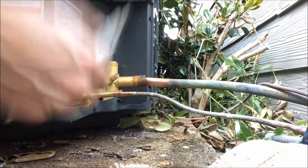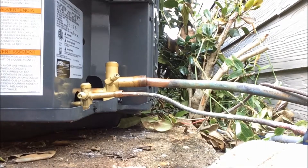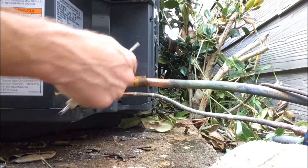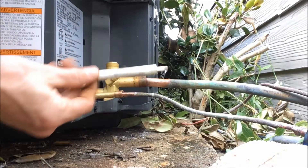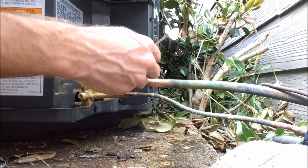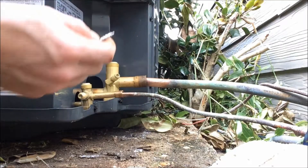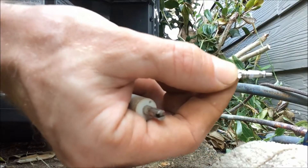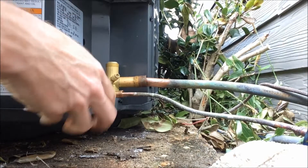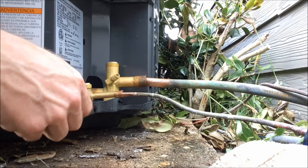I have sanded down my copper and I've taken off the covers for the valves. You need to have a valve stem tool — you need to take these valve stems out. This is a bicycle valve stem. You've got to have a valve stem remover tool to do this. You want to take it out — that's what a valve stem looks like. You want to take both of these out because what will happen is, even if you put your cooling towel over it, it will melt. There is a little piece of plastic around the center of that valve stem, and you'll melt it with your torch.